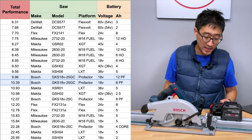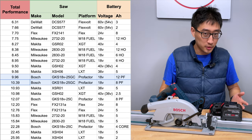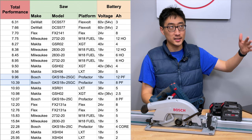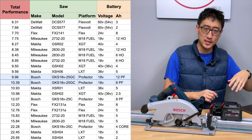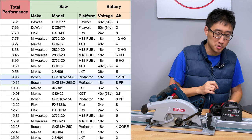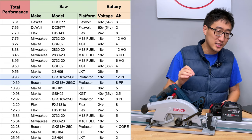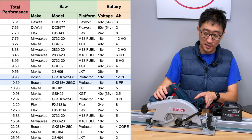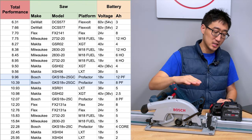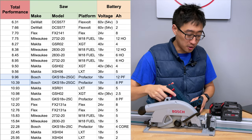I don't have the Bosch track, so I can't tell you all the finicky stuff about that, but it does work with the track systems from other vendors, like Festool and Makita. I think PowerTech is probably one of those off brands. I'm sure it probably works with the Wen, if I had to guess. I'm relatively sure it will not work with the DeWalt track, mainly because that one is not compatible with anything except DeWalt. But it does not take full advantage of the track, because like I said, it doesn't have adjustment mechanisms for the track, and there's no mechanism to lock the saw in the track in case you are making a bevel cut, aka the saw is just going to fall right off, right?